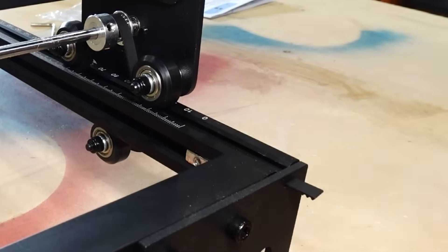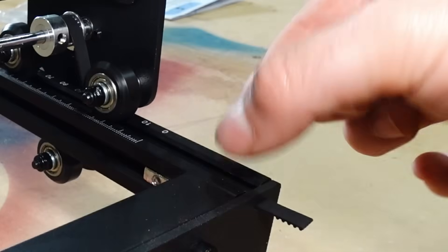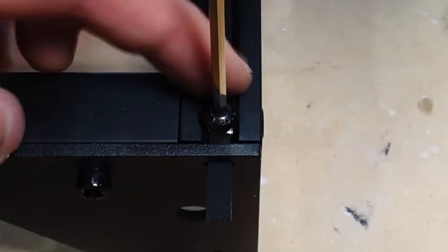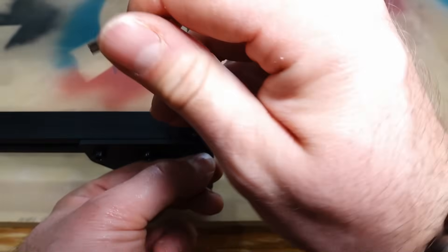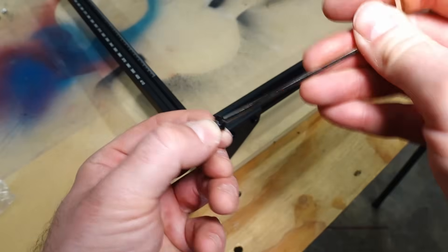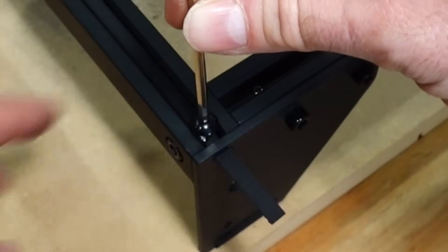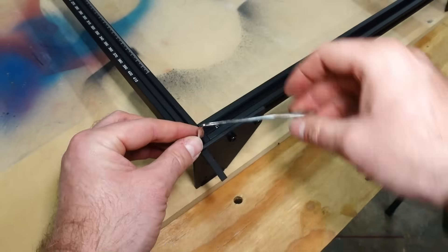Get the belt as tight as you can, laying flat across there. These are the little locking screws — you place that down in and when you screw it, it's going to twist the silver piece into the frame. You don't have to make it super tight because you'll probably tear through the timing belt, but you do want that little silver piece to start turning and lock into the frame. If it did not do that, start over and make sure that it does.